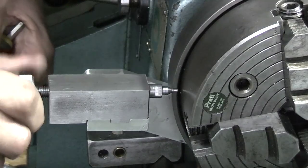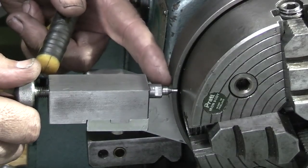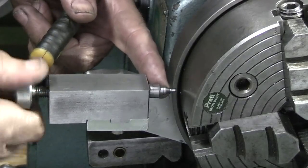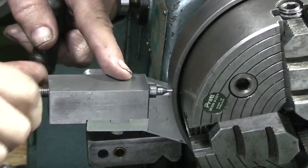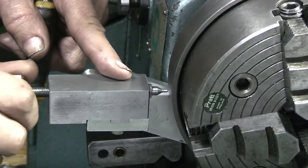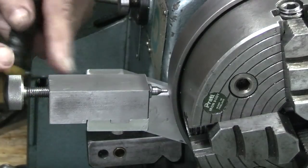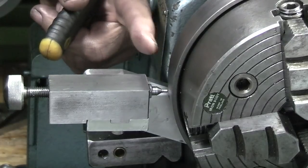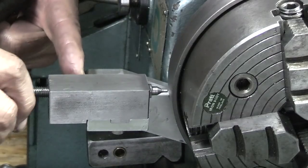As you push it in and start to tighten up on this screw, it feeds the plunger forward. I had to put those two flats on so I could get the spanner on to tighten it up on the end of the shaft. You can see there — if that was a hole with a countersink in here, that would easily do it. I may have to shorten the end of the plunger. This screw screws into the back of the plunger and you just have to adjust it to give you the length that you need.